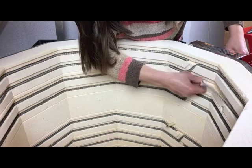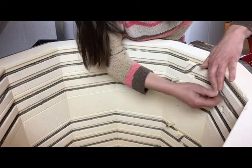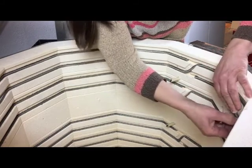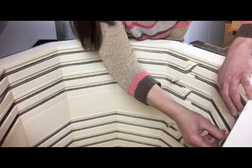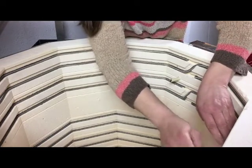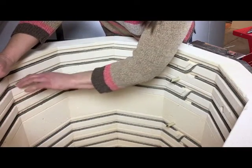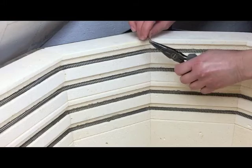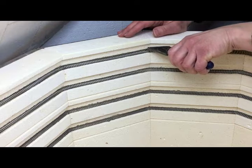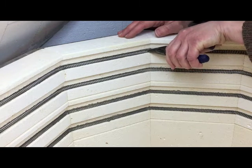When the tails are through the kiln wall, go back and push the coils all the way down into the groove. If you wish, you may use element staples to hold the element more firmly in place, but they are not required. You can secure your new element using your element staple. Hold the element staple with your needle nose pliers and push it into the brick at a 45-degree angle until much of the pin is seated inside the groove.